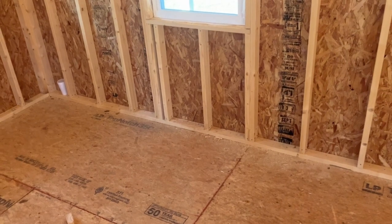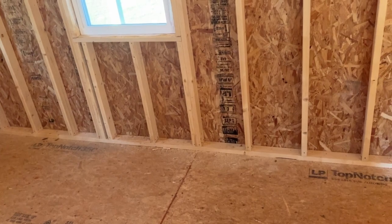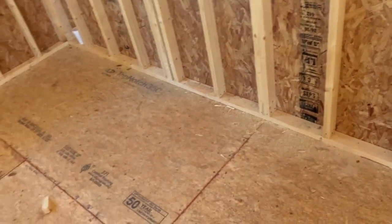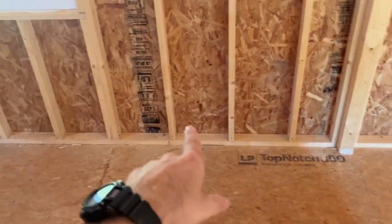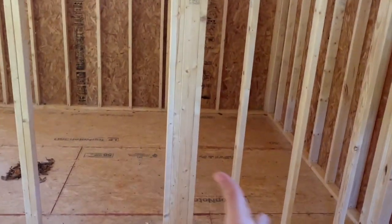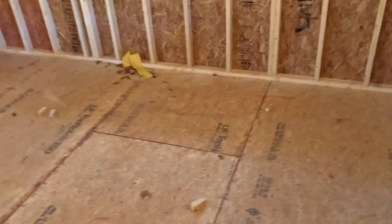I think it says outlet boxes should be no farther than 6 foot apart on each wall. So we usually do 2 to a wall on a standard room. I think this one's like 14 by 13. We usually do 2 to a wall, 1, 2, 1, 2. Obviously if the wall has a door in the middle, there's only one on each side.